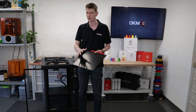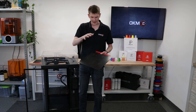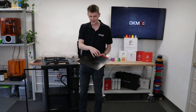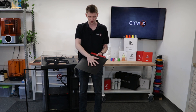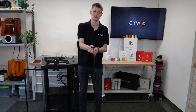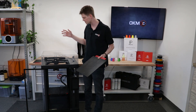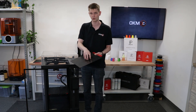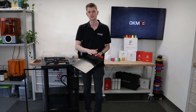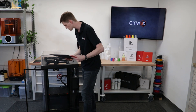They apply a special adhesive and then press the surface onto the plate with incredible force — something like 100 tons. This special application process means the customer doesn't have to do it anymore. Instead, you now get the P surface pre-pressed to your aluminum plate. There's no way this is coming off, no matter how hard your part tries to warp. You still get all the great characteristics with polypropylene sticking really well to it. Also, the chance of air bubbles becoming trapped underneath is significantly lower with this pressing method.